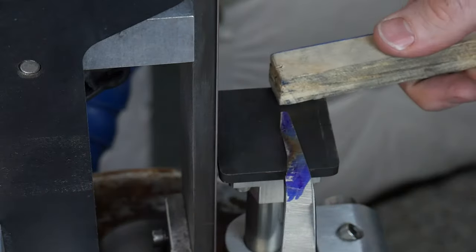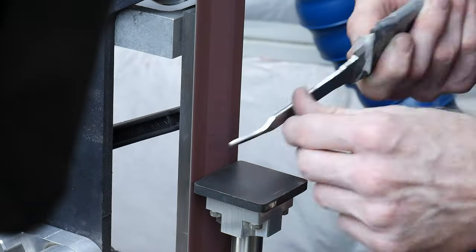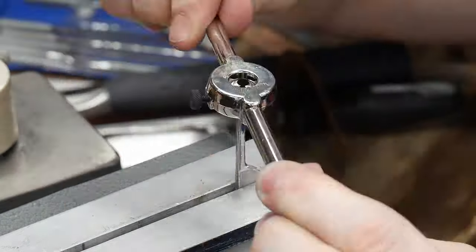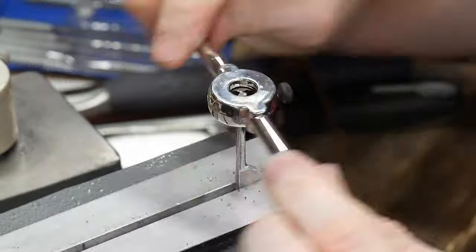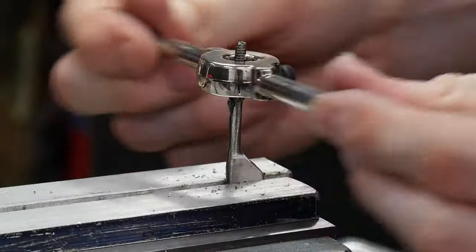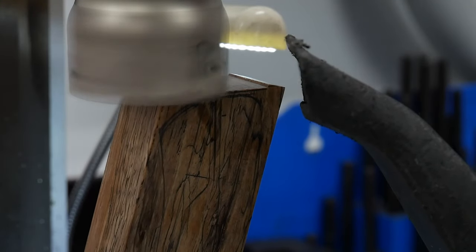With my slot milled around two-thirds of the way through the block, I lay out where I want my threads in the tang and grind down to my marks. On this knife I'll be threading my tang to a 6-32 thread. Once I hit my target dimensions I roll over the corners to make this part of the tang round. I'm leaving my tang threads extra long to give me some wiggle room, since the hardness of my tang has been drawn out with a torch, making this threading process fairly easy.